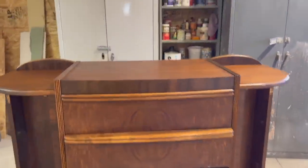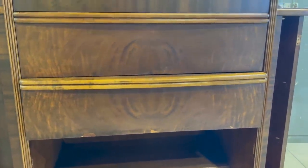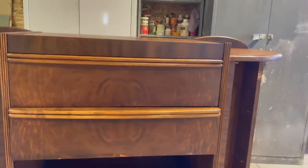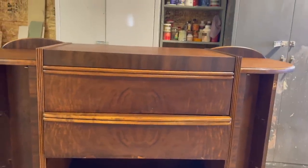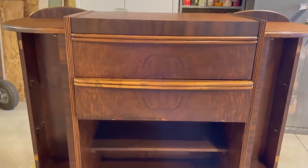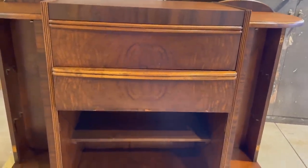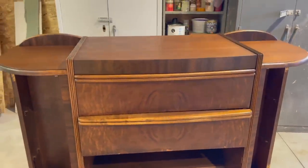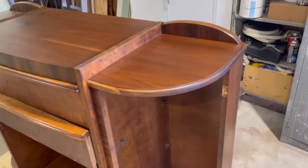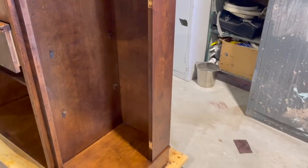And I did actually take this second drawer down here back to the workbench, strip it, sand it down, and just clear coat it totally natural, because it was a little too deep in tone. And I just didn't have any room to work with the colors. So that's a redo. And we've got a bunch of our veneer touch-ups there that have no stain on them, so they're really sticking out. But other than that, everything is looking really good. It definitely needs some toning work, but it's all in the zone of fixable, so that's good.